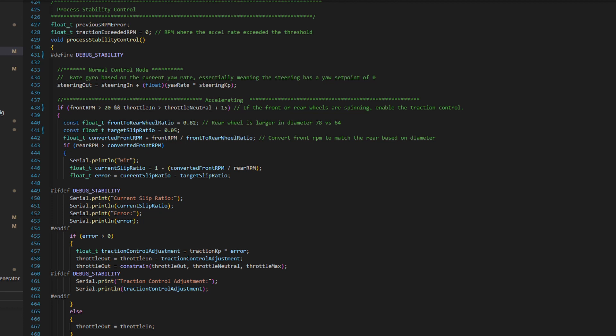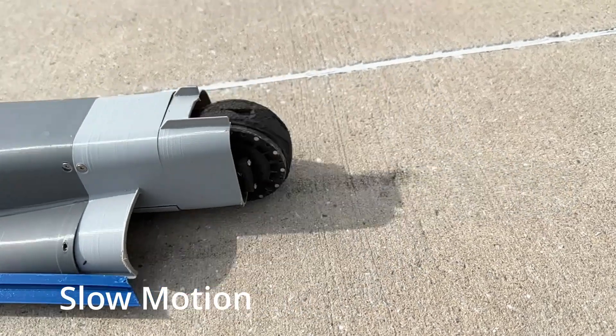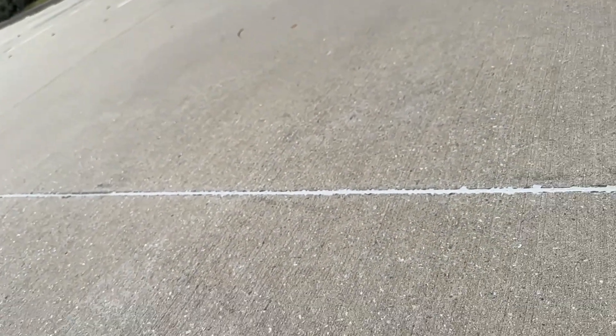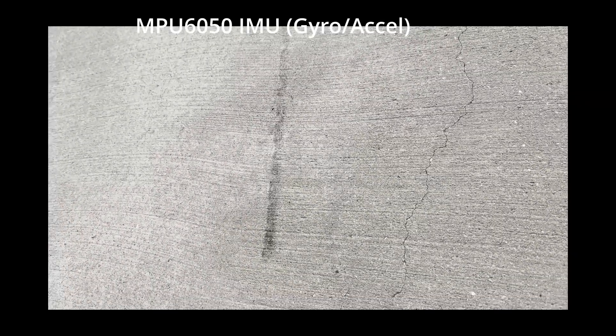Based on testing with other cars, it really should have a PI controller — a proportional-integral controller — which has an additional term that accumulates the slip rate over time and gives a more responsive controller. But I didn't want to take the time to tune that, as PI controllers are a lot more finicky. Even so, the traction control isn't perfect, but on really smooth concrete surfaces the car is able to move itself forward in a straight line without destroying the rear tire.